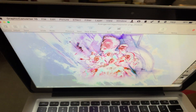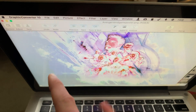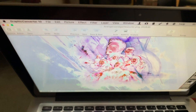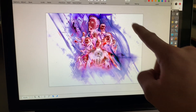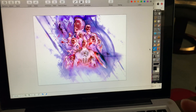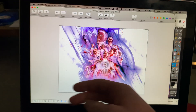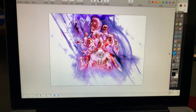If I angle it you can see there are these weird specks all over the place. I want to crop it in to just this area, and I want to make sure I'm not wasting laser time because it'll try and engrave really light spots. Cleanup is done. In these white areas there's a bunch of extra pixels — not quite white — that the laser will pick up and try to engrave, wasting time and putting a weird finish on the pumpkin surface instead of leaving those areas untouched. So it's ready to go — let's save this, import it in, and go prep the pumpkin.